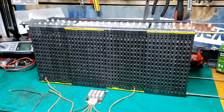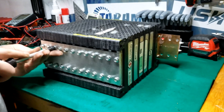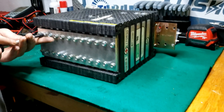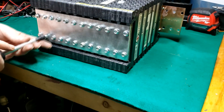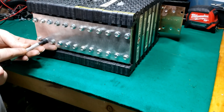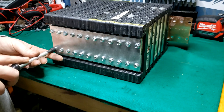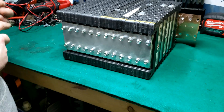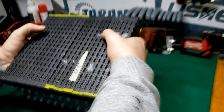Hey YouTube, today putting together a SPIM 08 HP lithium battery bank. This one is 4S6P — four in series, six in parallel. You can see the first link bar here has 12 spots and the end bar there has six spots.